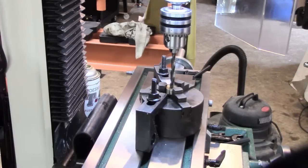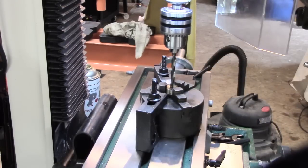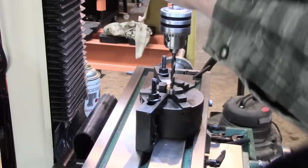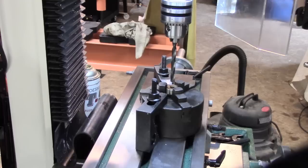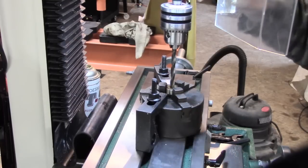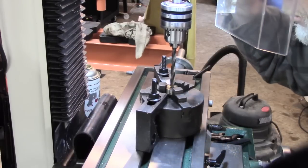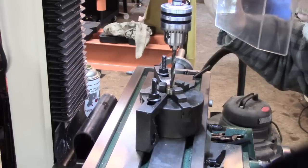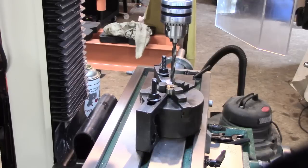Well, this is all I've done for setup. It's pretty primitive, really, but adequate, I think, for what I'm after. I've used the 8mm. Let's unlock the quill a minute. I've set the 8mm drill in there and checked it, that's pretty well okay. So I'll take the chuck out. I've locked up the X and Y. So we'll get the chuck out and put the milling cutter in.